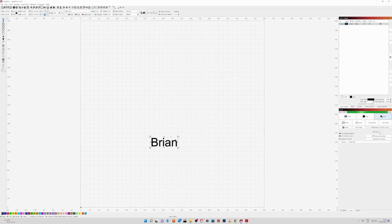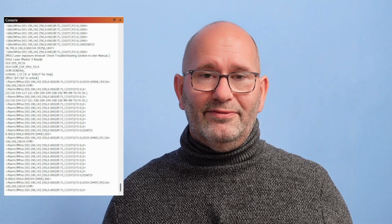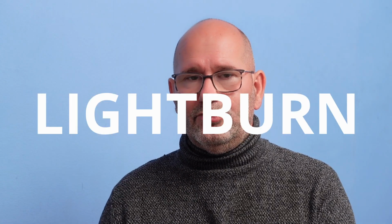So I contacted Ortur and asked their service team what the hell was going wrong with it. And in the end, we found out that the connection with Lightburn was the problem. And this hasn't to do anything with the laser. It has to do with Lightburn, because Lightburn is the one not using the perfect GRBL command set, and therefore not being compatible with this laser.